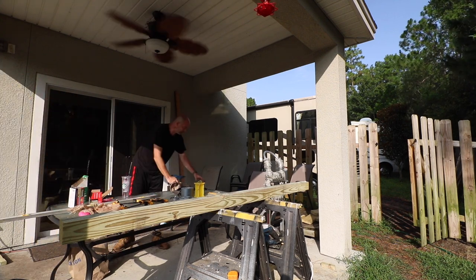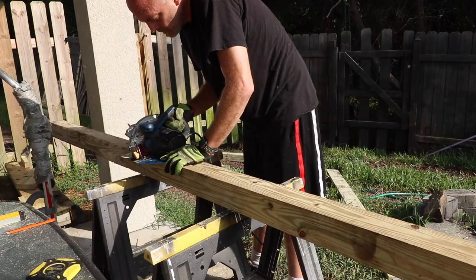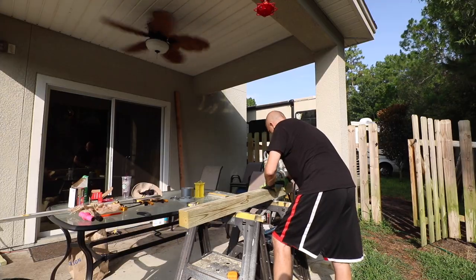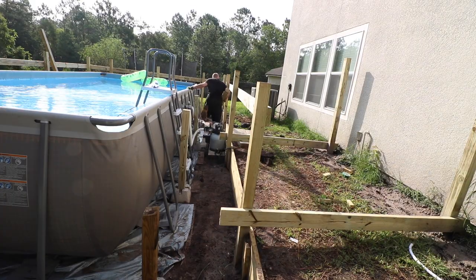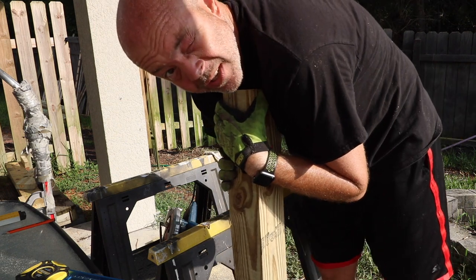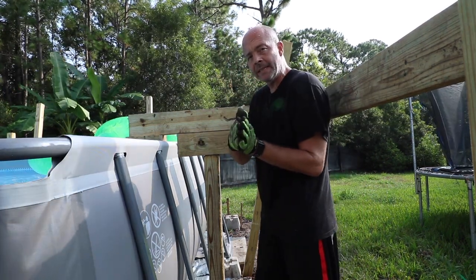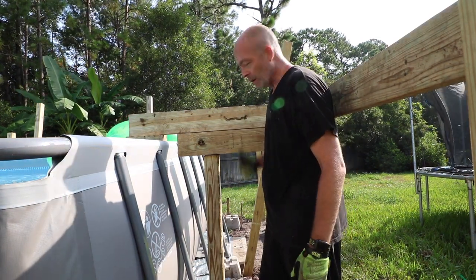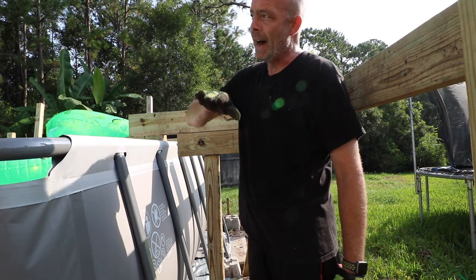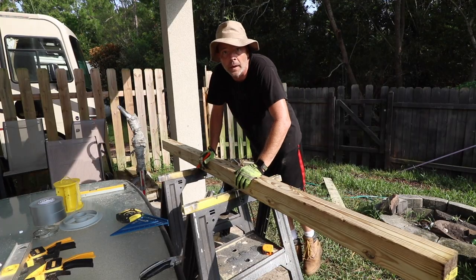I've got to get my framing square, move some of my stuff out of the way, then I can get to cutting. Now I'm going to take this one and test it with the jig to see if it works. When this is parallel — spot-on cut every time. That's how all the posts will get cut. Then I'll be able to make my two 2x6 beams together, put it on here with hurricane tie-downs. Four more posts are measured, and then I have the corners to do — I'll measure those by putting beams on these posts and measuring level across. Starting to get too sunny, so I've got to put the hat on.